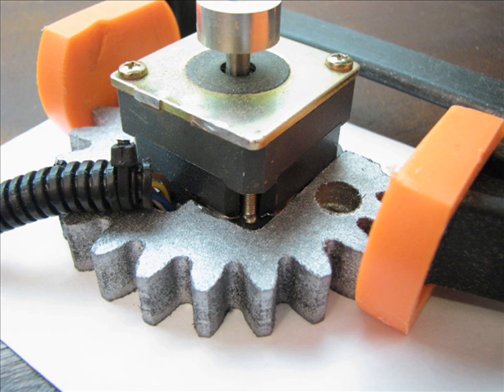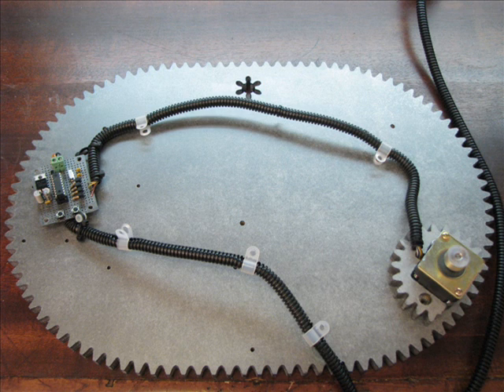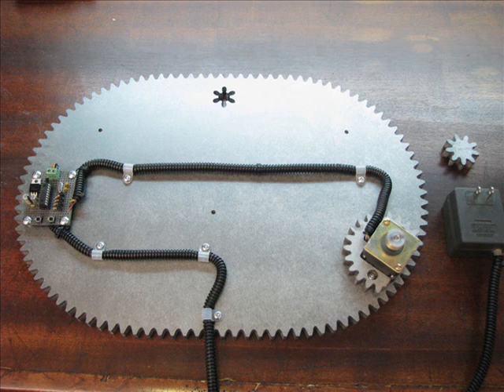Here's a picture of the stepper motor — to fix it properly it was epoxied in place, which is the only glue used in the system. The wiring is very simple: there's one 12-volt DC line coming in at the bottom center that powers the controller, and the controller has five lines going over to the stepper motor. Cable ties were important here to secure the lines to the backplane, keeping them out of the way of the gears and keeping everything neat.